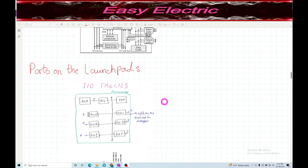There are a few ports on the launch pad. There are six ports called A, B, C, D, E, and F. In general, each port has eight pins, but some pins are reserved and technically you can't use all eight bits. For example, in port C you can only use four of them - the other four are reserved for other purposes.